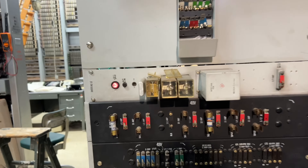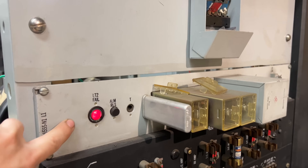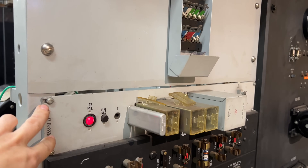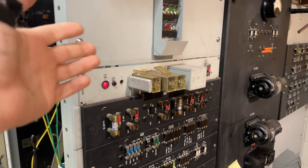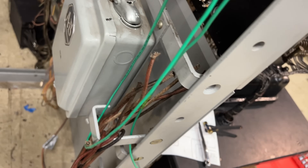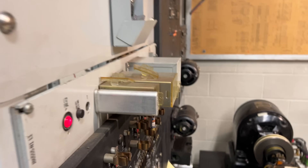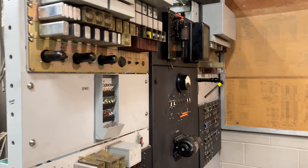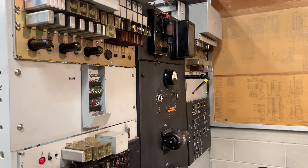And we've got an LT2 fail over here. That means that this circuit is not detecting dial tone coming from the machine. The reason we were getting an LT2 and all these other alarms is because the output from the machine right there is, as you can see, not going anywhere. So the board is unhappy, but I'm very happy, because that shows that it's working, which is exciting.